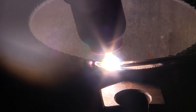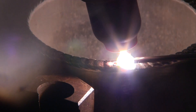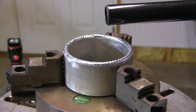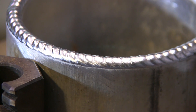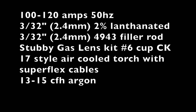The reason 50 Hertz works well here is because I want a wide bead — I want the toes of the weld to completely wrap around the corners. This would be like a buildup project, like if somebody mismachined a part and took off an extra 30 thousandths, and you wanted to build it back and turn it back down. It's also really good practice putting a piece like this up in a turntable — welding aluminum really gets that filler wire hand up to speed.